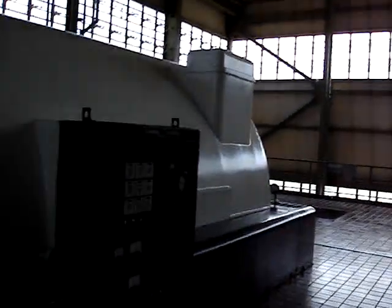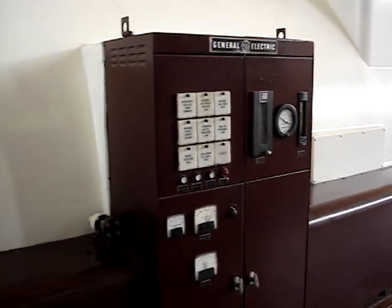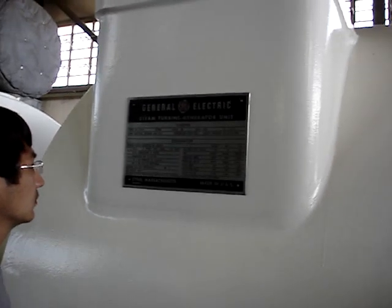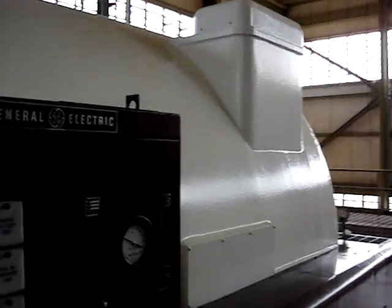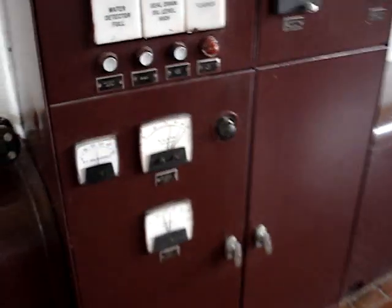This is the generator here. The generator is rated at 112 million watts of power per hour. Because of its age and the turbine condition, we usually squeeze out about 107 megawatts — that's what we ran last summer. There's the faceplate if you want to take a look at it. It's a hydrogen-cooled generator. We use ultra-pure hydrogen to cool down the inside of the windings. The older ones are air generators — the two out there are air-cooled with air circulating through them. Using hydrogen enables us to get higher megawatts and reduce the heat and stretching involved.